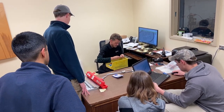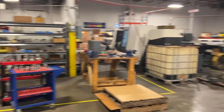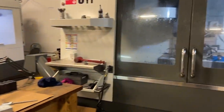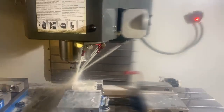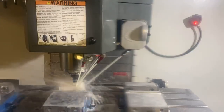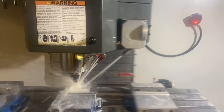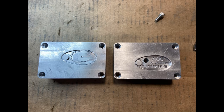Amon headed out to his father's shop to pick up the mold. Here at Altec Industrial, a local manufacturing firm in Decatur, Georgia, we hooked up our aluminum blocks to the milling machine. This sped-up footage shows the milling machine hard at work crafting our molds out of an aluminum block. The hard steel of the end mill removes the required negative space while high-pressure water jets spray at the milling point to blast away waste aluminum and cool the part. The end result was a durable mold with an excellent surface finish.